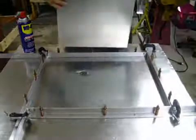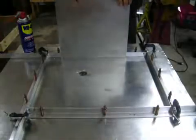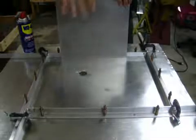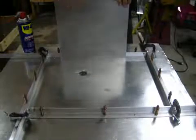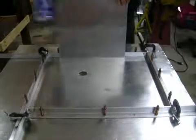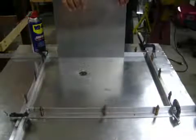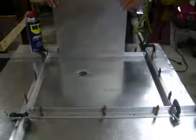As you can see, I have two starter holes drilled here that the bit will go into as I start to make the openings. I'm wearing safety goggles, and when you do this you want to keep your fingers away from the cutting bit, obviously. A little WD-40 goes a long way in helping the cut along and increasing the life of the bit. The cut itself is actually a little cleaner if you use a light lubricant like WD-40. So let me show you how this works.